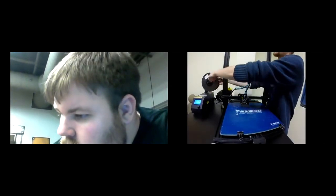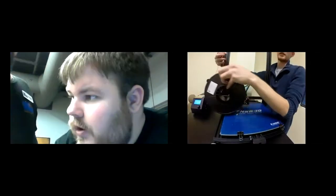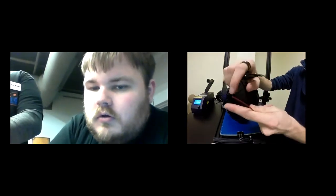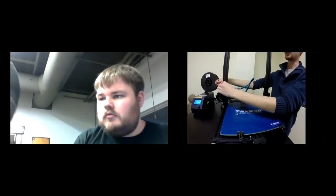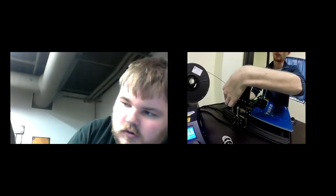Mine is heating up — about at 220. I recommend cutting the filament at a sharp angle before you feed it through — it makes it easier. I'll cut it at an angle like this. Right here in the back, just like the A5's load — you're going to have the yellow trigger, squeeze it, and place the filament all the way through to the other side and through the tube. By now, if we preheated it, it should be hot enough that we can squeeze the filament out immediately. Once you feel the back pressure hit, keep pushing a little to clear out any old colors.